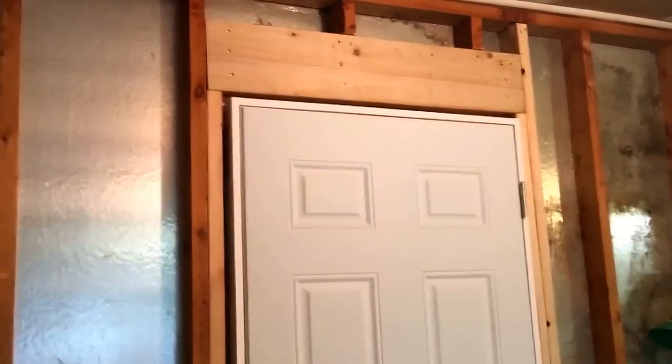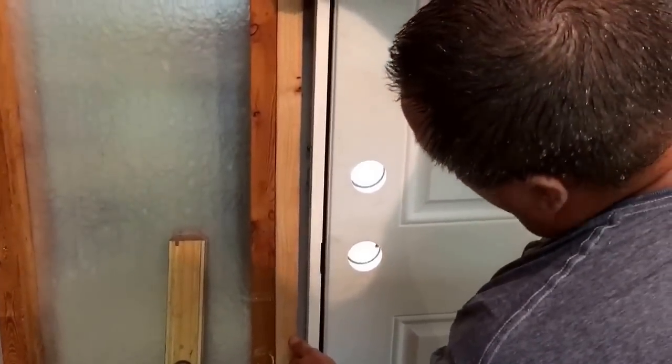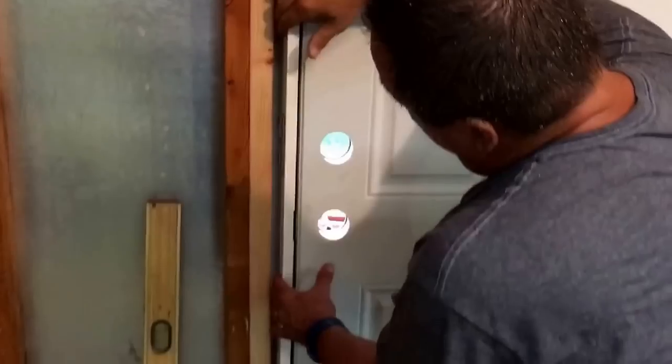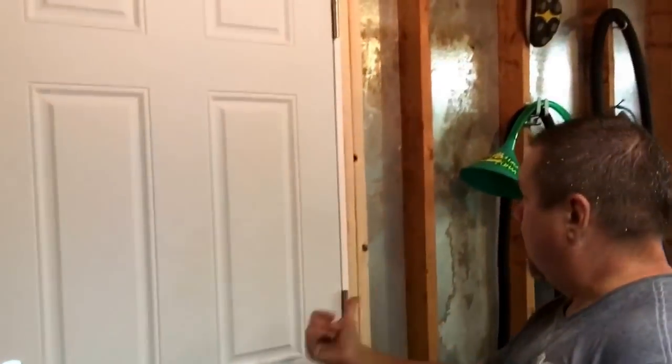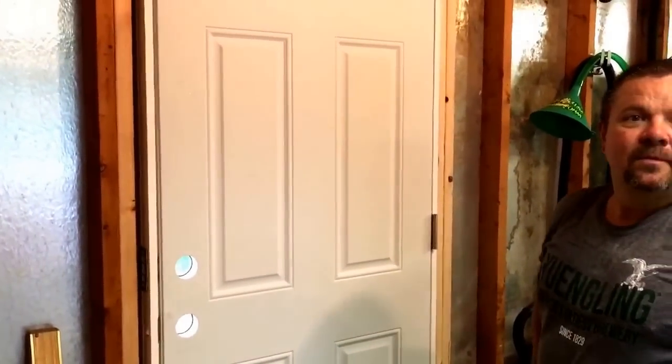About the reveal — see how it's tighter up here and tighter down here but loose here? What we'll do when we shim the door and put our nails through this way is get that reveal tight. You put more shims in that area — shim on each hinge with long screws. We don't have any shims on the side today; that'll be finished Monday. But this is how you install a door with the pros.